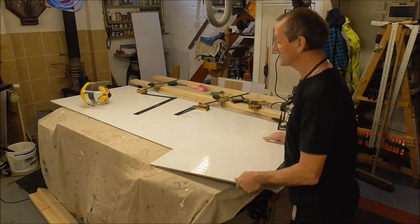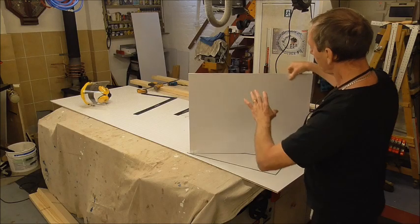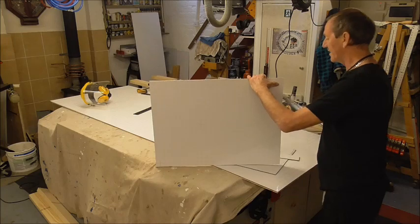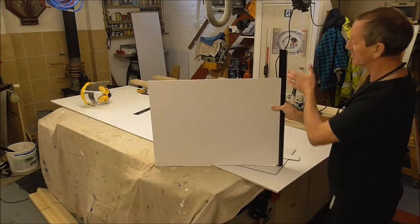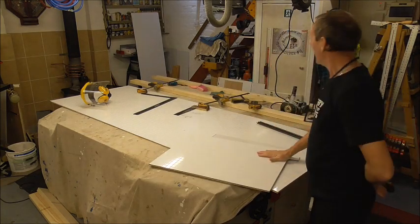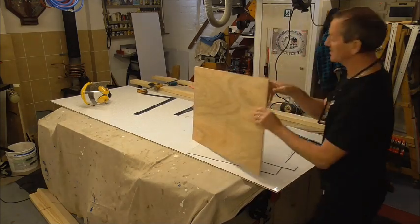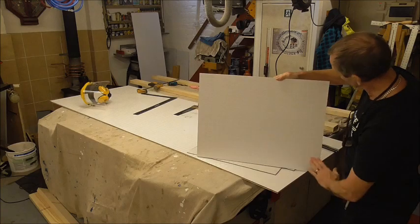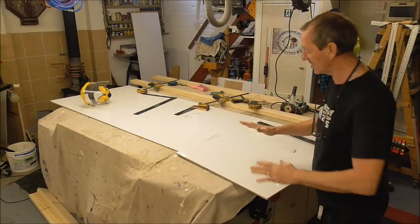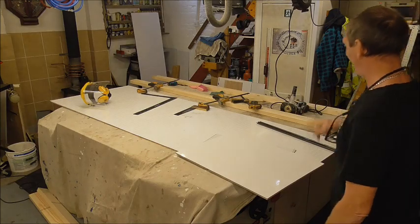Then for the bath panel, obviously this is one of the bath panels. This is the end panel. Bonding it to plywood gives you that strong feel to it, and then we can profile it in, although we'll have a bull nose going down the corner of the bath, and then do the other one. And that basically is it. As I said, when you're trimming off, you'll see here, very nice finish, and that's because that was done with a router. And you just trim it off like you do with any other Formica. It's quite simple. Right, now I've got another bath panel to trim off. I'll get on with that.